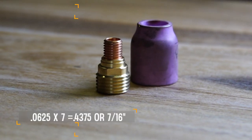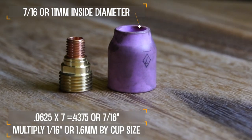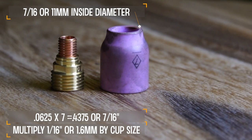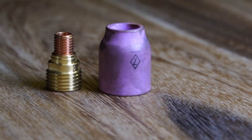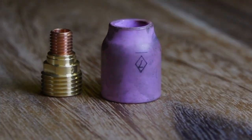That cup should be out for the count. The downfall to welding stainless tube with a small cup like a number seven gas lens is that the cup really isn't big enough to take long runs around stainless steel tube. You can only go a little farther than its radius before it starts to allow atmosphere to bleed into your weld pool and cause bad oxidation. This really isn't efficient for our discussion today, so I'm also going to boot this cup from the topic.